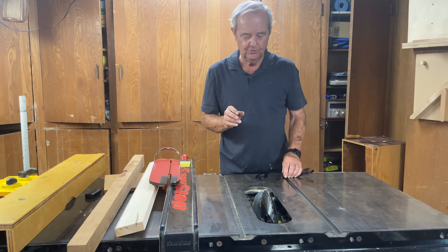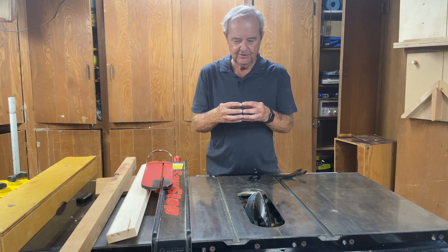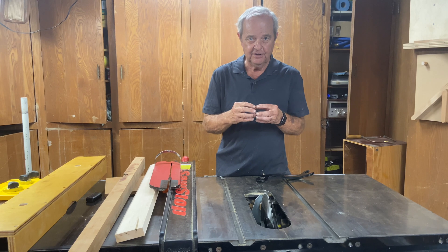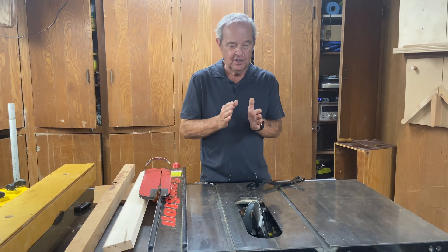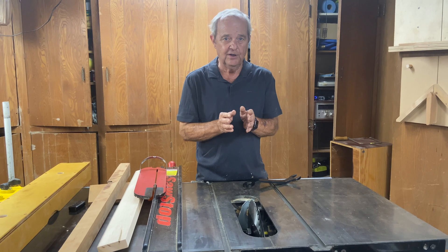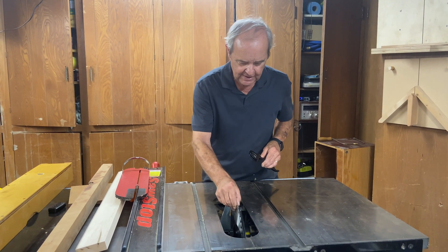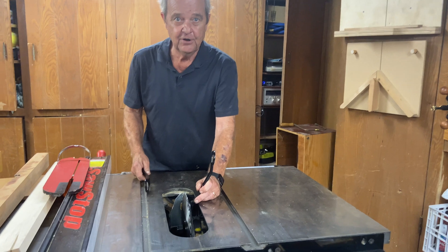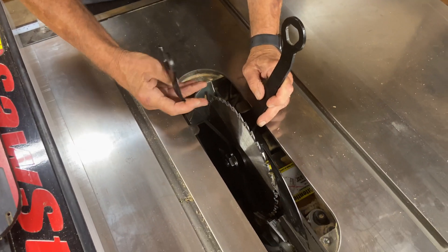You can't have it too loose. But remembering the geometry — there are two washers on both sides of the blade with the nut pressing in the middle — if you cinch down that nut too tight, you could actually warp the blade. Even a thousandth or a couple thousandths of an inch of warp means the blade will wobble slightly, and you won't get a quality cut. It could potentially be a safety issue, but in reality it's primarily a quality-of-cut issue.